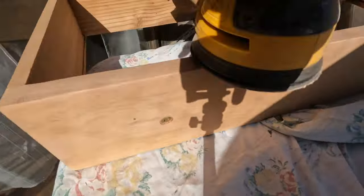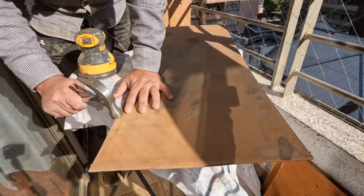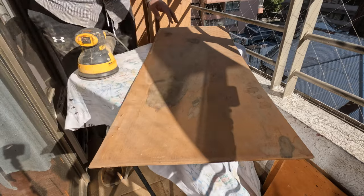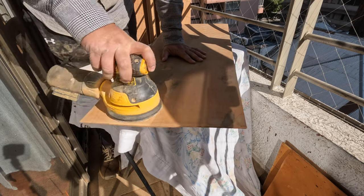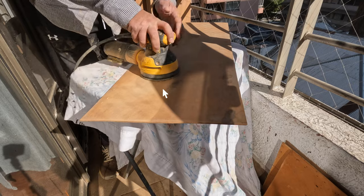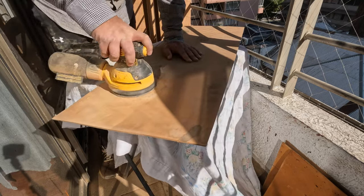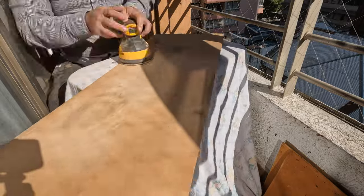Well, I enjoy sanding, so that's why I feel satisfaction when I see and feel smooth wood. This is one of the drawer's bottom panel. You can see that it is bent, and so filthy. This is water damage. I could use oxalic acid to try and remove these stains, but I plan to turn them upside down and use the bottom instead. So they will not be bent downwards, but upwards, if that makes sense.